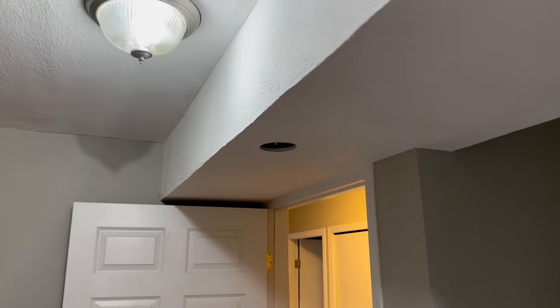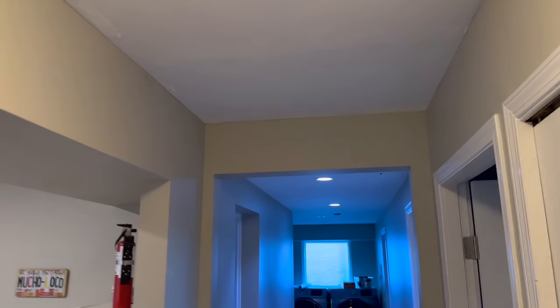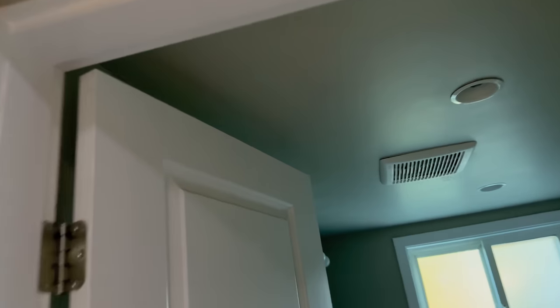If I was to even attempt to get a bathroom strobe, this is the duct I would try and run a NAC down this side, because I wouldn't bother trying to cross that NAC over. It'd be too difficult. But this goes down. I think it goes for quite a ways because the ceiling is dropped in there. Not sure if it's dropped quite that low, but it might be possible to get one in this bathroom that way. I would have to do more investigating.